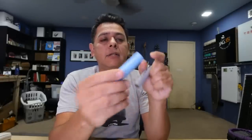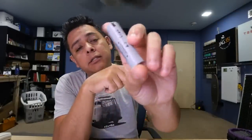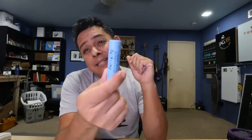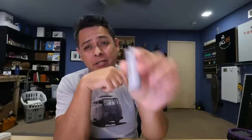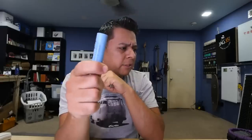These ones look like they have been put together in a pack. This one looks new. But anyways, these are the same ones that we sold the other day. NCR 18650 BD, 34. This one gave me 3400 milliamp hours. This one gave me 3600 milliamp hours. This is supposed to be a 10 amp cell, but it gets hot. So I don't care what the data sheet says. These are probably more like 7, 8 amps max, so that you don't heat up too much. Did I do a video for this one? Yeah, I tested this one. I have the graph on this one too.